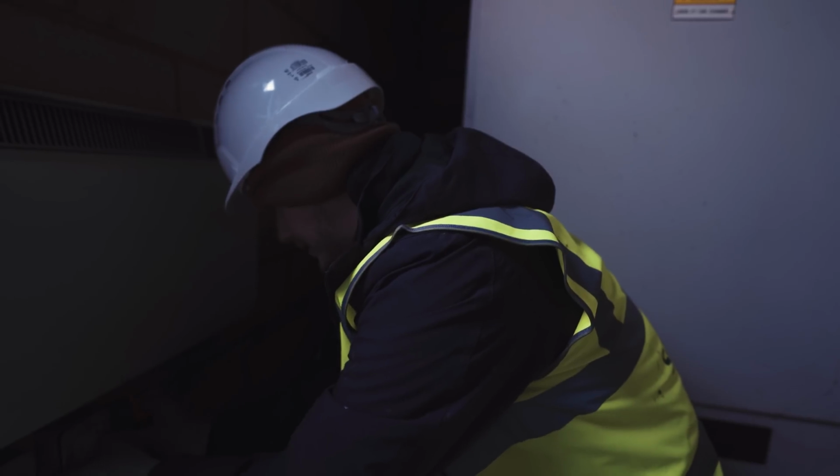This is incredibly tight. They've made this off and nicked all the slack elsewhere for sure. But we'll put that on there, 0.28, which is lovely and low to be honest, considering this is quite far away. 0.28. And that's that done.